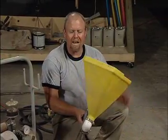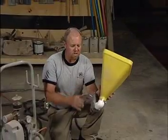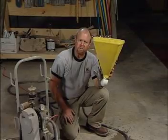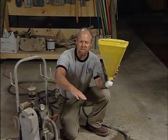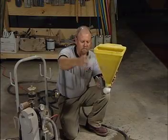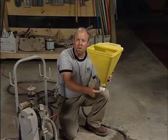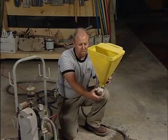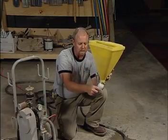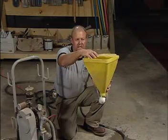There's a wide variety of hopper guns available in today's marketplace, so this is just one example. If you're spraying your material — your cement-based topping — onto a horizontal plane, your hopper has got to be in a vertical or upright position. So in order for that to occur, you need a 90-degree elbow right here. If you just had a straight piece, the hopper gun would be angled incorrectly. So you need to make sure that your hopper gun has the 90-degree elbow so it stays upright.